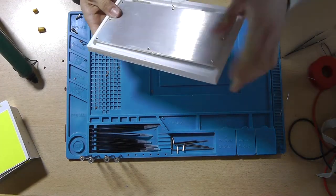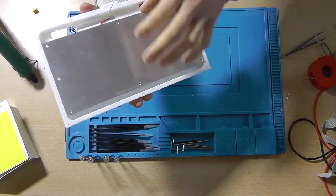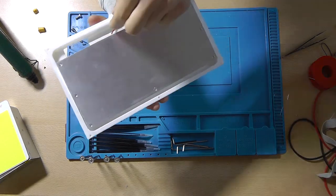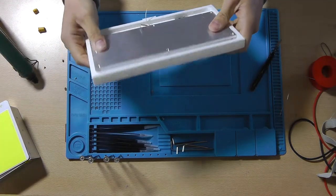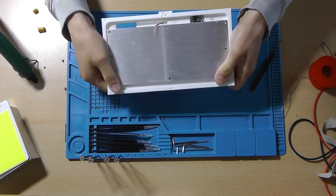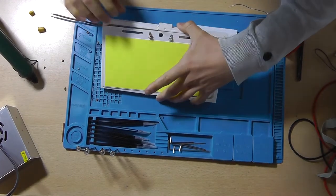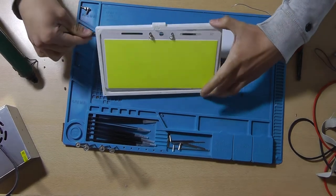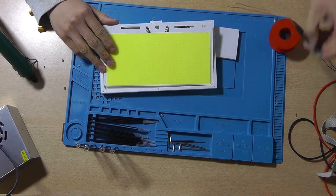After that, we'll be installing the heatsink. It should all match the holes that are in the 3D printed case. The holes should be used from the backside, and the screw will go all the way through to the heatsink, and it should pull the heatsink firmly onto the case. After using some hot glue to add strain relief to the wires of the COB LED, it's time to guide the wires of the COB LED through the case, and then you'll want to install the connector that will be used to power the COB LED.